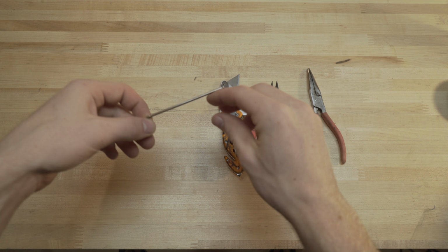But so now you can tell what we're going to need. We're going to need the other plate on this side to finish it up and pull it together and sandwich all the things together. So what I like to do first is put the bolts in this piece first. For this we're going to be using 35 millimeter standoffs. These are like the medium size standoff. And you can see we're just going to run it through just like so. One bolt, and the standoff just goes on the other side. So you're just going to screw that down.